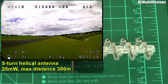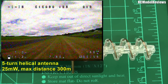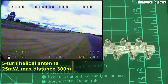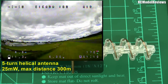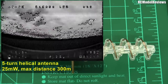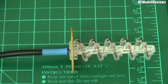Let's fly past the DVR and see what's working behind it. Notice we're getting more flickering here. I was actually quite surprised at how much signal we got behind the five-turn helical — it's working really well behind, which is a huge surprise to me, because it should not give us very much signal at all. Then I decided to see how the helical performs when you fly out to the side. Flying directly at right angles to the helical — basically it doesn't. We lost the signal pretty much immediately, and the DVR just decides to stop. It's had enough — not enough signal.